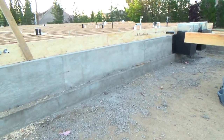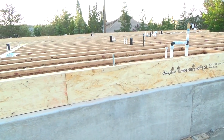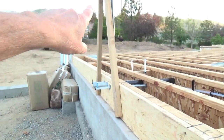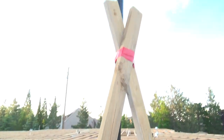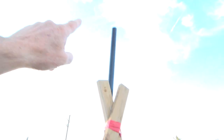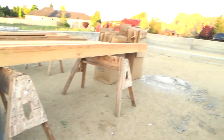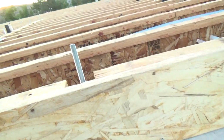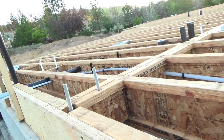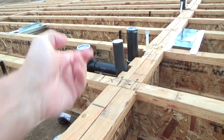I was thinking about what these plumbers have to do next. We're just going to talk about plumbing on this video. I see they've got a vent pipe here, supported and run up there. See how high it is? We're getting ready for an inspection. They've got to fill that up with water — they've got water over that direction — and they'll fill it up with a hose. When the inspector's here, that's how they check out the drain line.